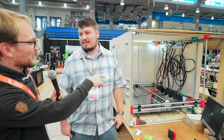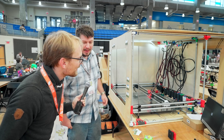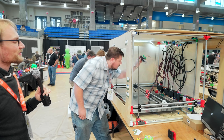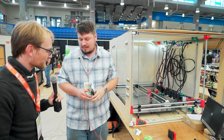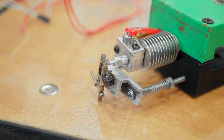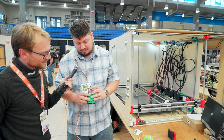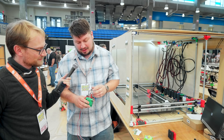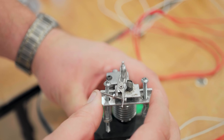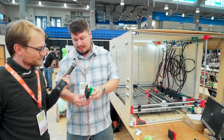There's another tool head — a threaded insert installer. Because installing threaded inserts with a soldering iron is kind of painful, they worked on automating that. It's basically an E3D V6 or J-head with a machined aluminum rod and an alligator clip. Every time it docks, a threaded insert comes down, a servo pushes it forward into the clip, and then the clip rides up and pushes it in.